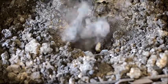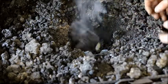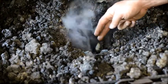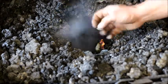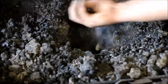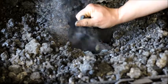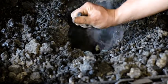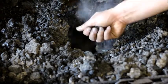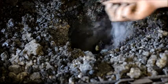We're here at the coal forge. Right now I've got yesterday's fire — breeze and whatnot — with a paper towel lit and kind of smothered down in the bottom of my fire pot. If you're starting out completely with green coal, this particular coal I'm using is what I buy at SOFA — Southern Ohio Forge and Anvil — and it's Pocahontas coal. It's a soft bituminous coal in a pelleted, pea-shaped form. You can get coal in all sorts of sizes; if it's in big chunks, break it down to about an inch in diameter.